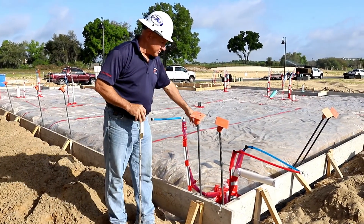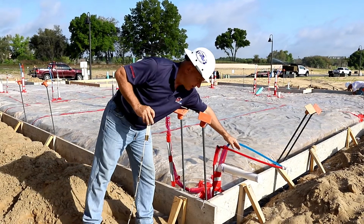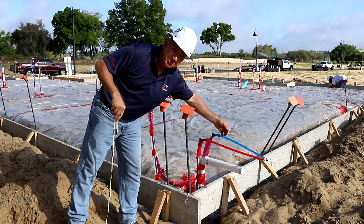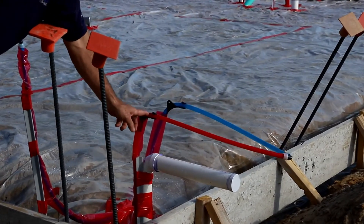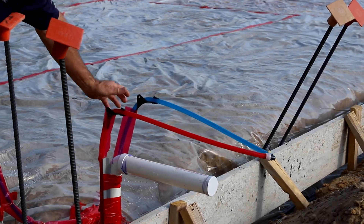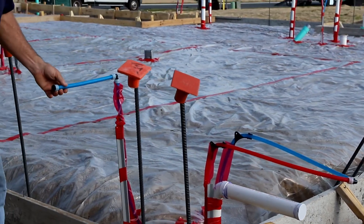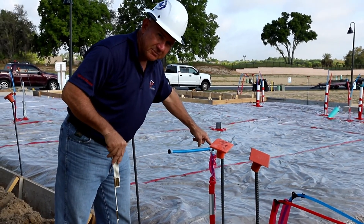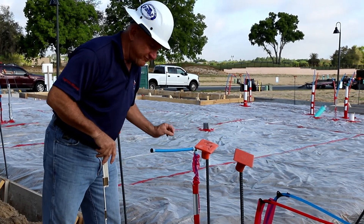This is one of the sections where the plumbing rough-in is installed. You can see that they tie the hot and cold waters together — this is simply done to pressurize the system. We have the prefabricated 90-degree bends right here on this pipe as it comes out of the wall. It's marked out, taped, and sealed up. These are literally going to be inside the concrete wall. Here they have a fitting which is going to be inside the masonry block — that may be a concern instead of having the prefabricated 90.